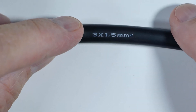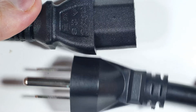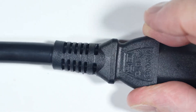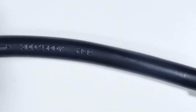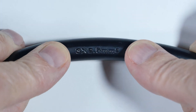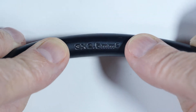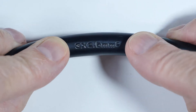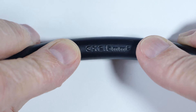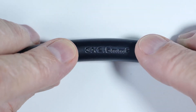I have one more option. The last one doesn't make any claims about ampacity on either side, but scoooting down the wire it says 3 × 2.5 square millimeters — three wires of 2.5mm² for ground, neutral, and live. Online I find it's approximately 13 AWG and capable of 17 amps, which I like because most breakers in my house are 15 amps, so this would sustain well before the breaker trips.